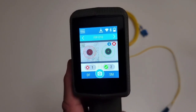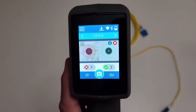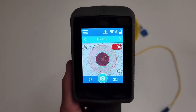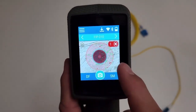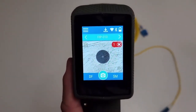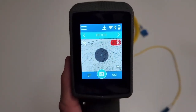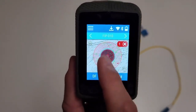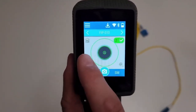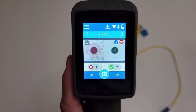This inspection capture shows two fibers on the screen. To zoom in on one, simply click on the desired fiber directly on the touchscreen. Let's select Fiber 1 for further examination. It's also possible to remove the overlay with a click on the screen. The image clearly shows the dirt on the end face of Fiber 1. Swiping your finger on the touchscreen allows you to toggle between each fiber individually. To return to the full view of the two fibers, select the zoom out feature and navigate further.